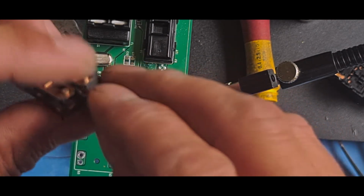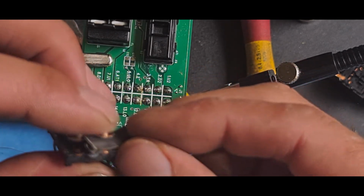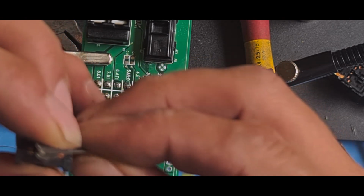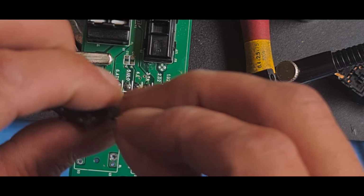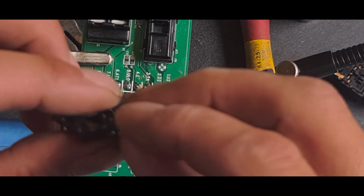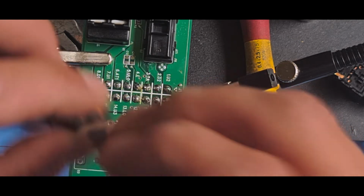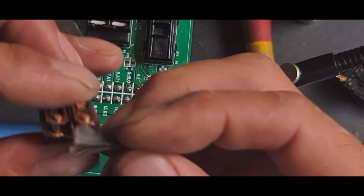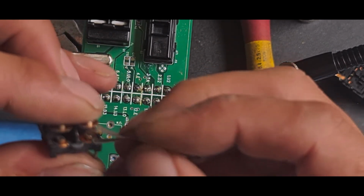Obviously you can dip these in isopropanol. I've got an ultrasonic cleaner I can use, which I could have put the whole board in. It would have slowly cleaned all of the surface off, but it could desolder or disconnect surface mount components. Doesn't normally, but it has in the past made springs pop out for me.